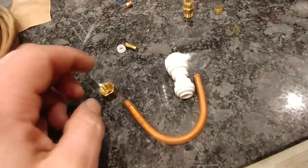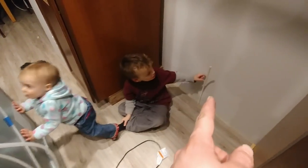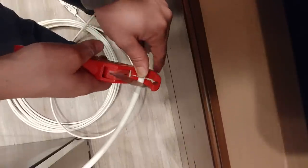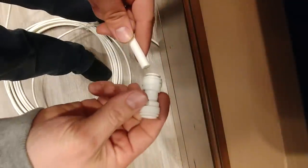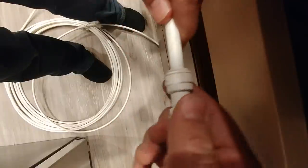But I don't need the stiffener or ferrule because I'm just using this little loop of copper to connect. And then I'll be using this adapter that goes from three eighths outside diameter to quarter inch outside diameter. Coming up right here in the back, we don't have quite enough PEX to make a nice loop. So we're going to add a little bit more water line so that this can loop up and have enough room to pull the refrigerator out when we need to slide it out. We'll go ahead and cut this little bit of PEX using a tubing cutter — link in the description to pipe and the tools you may need. We just have this straight coupling here that we're going to use, and you want to make sure you get these pushed on good.